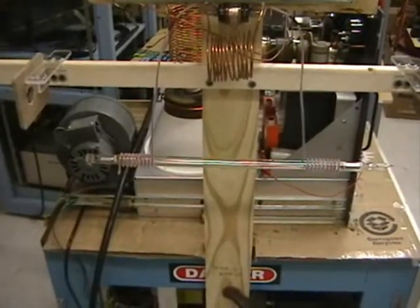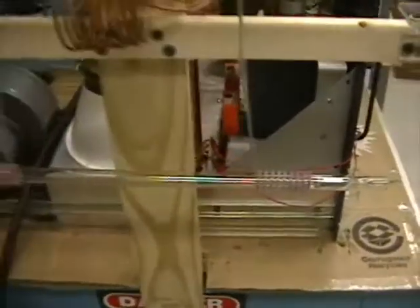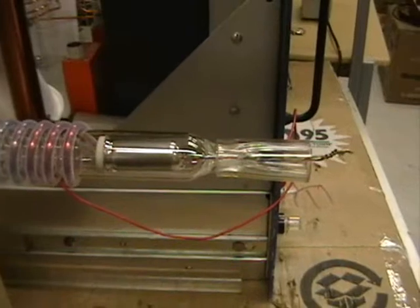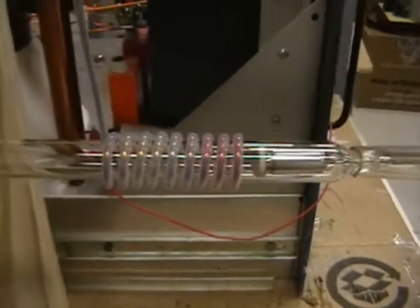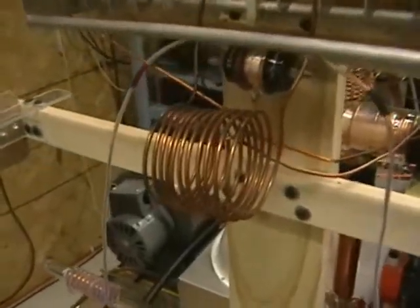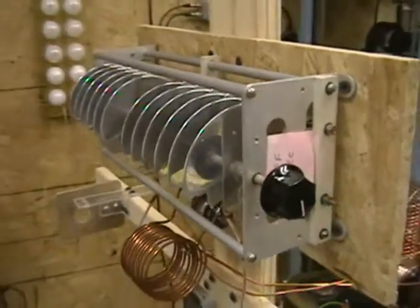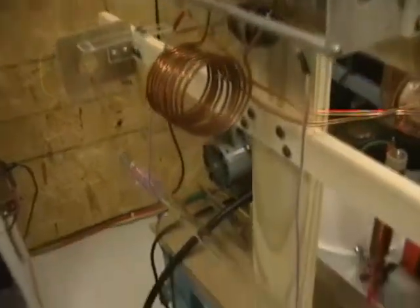In order to provide drive for the tube, a relatively high RF voltage must be supplied when driving the tube using coils wrapped around the tube. There is no electrical connection made to the internal electrodes of the tube, as the internal electrodes cannot withstand sufficient power at a high power level. Therefore, capacitive coupling must be used. To achieve this high RF voltage, a parallel-tuned tank network is used, consisting of a coil of copper wire which is center-tapped, connected across a large variable capacitor. This capacitor is adjustable to allow the frequency to be adjusted and to tune the circuit to resonance, providing maximum RF voltage to the tube.